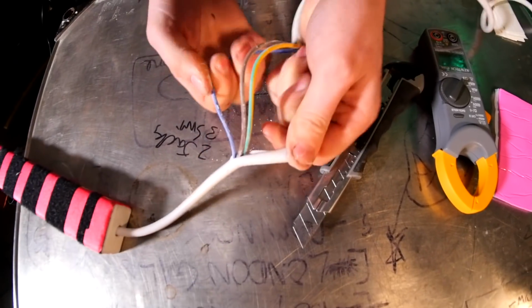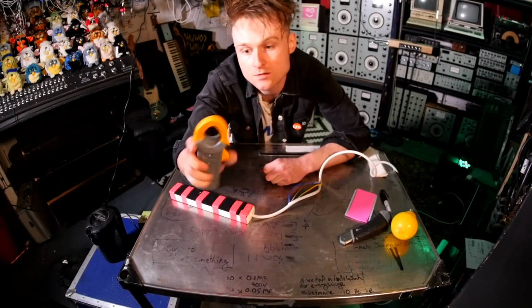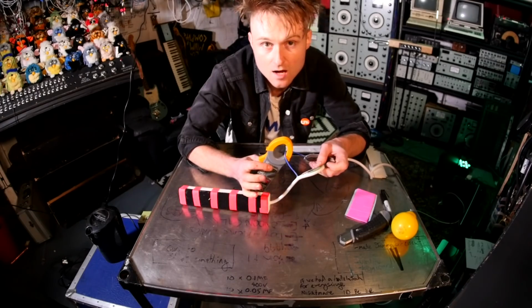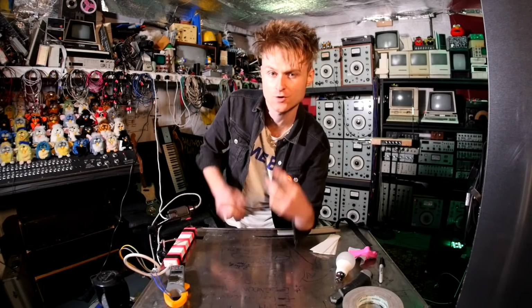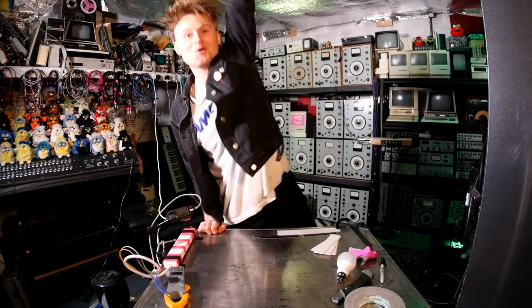Right, so what you have in here are the 3 different wires for the mains. All we need to do now is take the digital clamp multimeter and pop it on either the blue or the brown, just around like that, and we're able to measure the amps running through that wire. So I'm going to start with an obvious comparison, the kind of thing where one's going to suck more power than the other, but I don't really know what yet. I've got an idea!